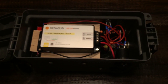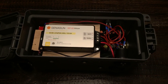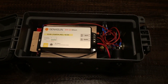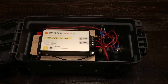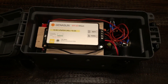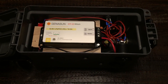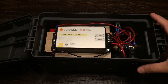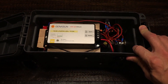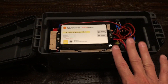If I do want to increase my wattage and charge this battery quicker, I can do that and that controller will take advantage of that algorithm. Also worth noting, this controller is significantly lighter compared to the old controller. So if you pair that up with this battery, it lightens this unit quite a bit. Based on everyone's feedback — and I appreciate all the comments — I am working on a new configuration. I got a different ammo box. This one is tapered, wider at the top and narrower at the base, which is impacting the new configurations I want to try. So I've got a different box and I'll cover that in another video.